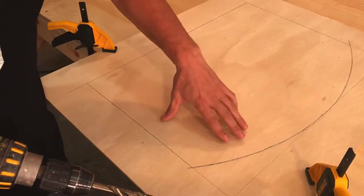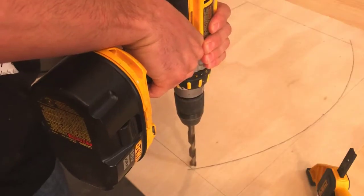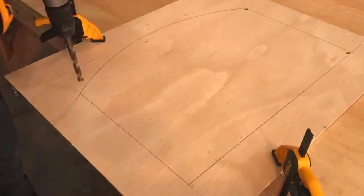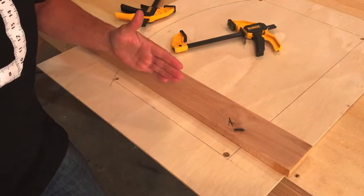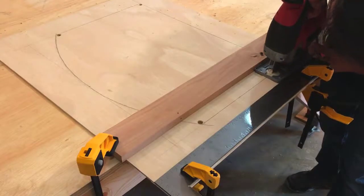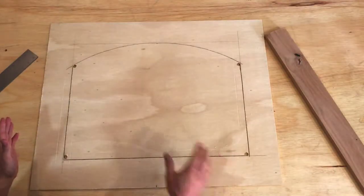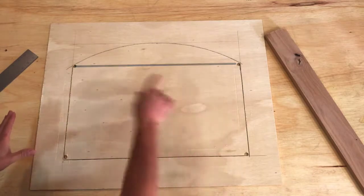We're going to drill holes in the corners of the shape that we're going to be cutting out. As you're drilling the hole, do not let the hole cross the line. We're going to set up the guide again so that our saw can cut nice and straight. You can clamp another guide on this side so that the saw fits perfectly right down the middle. Now we're going to do that exact same thing on the other two straight sides. Before we cut the arch, let's cut a straight line from this hole to this hole, just so we have less wood to deal with as we're cutting our arch.